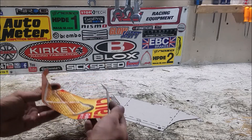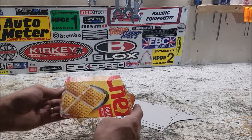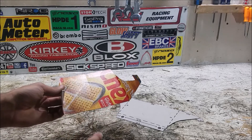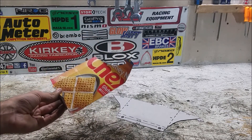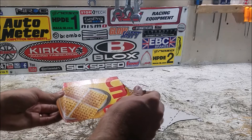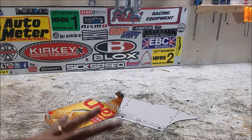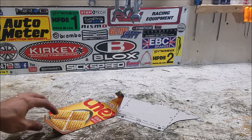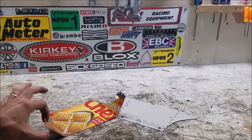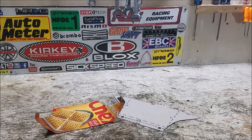Like any duct or vent, this is a pretty simple concept — I'm just using sheet aluminum to change the direction of the air under the car. I don't have it down very far, no further than any of the other plastics on the car, so if I hear plastic scraping I know it might be in danger. I'm making it out of extremely thin aluminum, only slightly thicker than a Coke can, so these two little tabs will tear off before doing any damage to the fan. I actually had this happen — I had to get the car towed because of a blown oil line, and when it was towed this was torn off the bottom of the car. That's why I'm remaking it. When it tore off it did exactly what I wanted: it tore right at these two tabs, the rest folded backwards, and did zero damage to the fan.